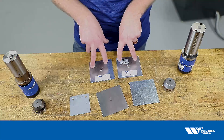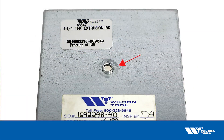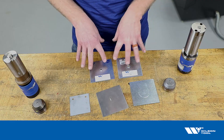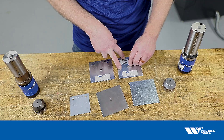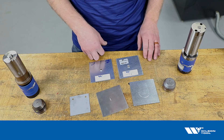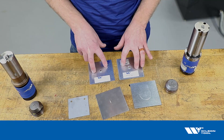Here we have an extrusion tool that has been run. This one shows a quite pronounced witness mark, and this one shows no witness mark at all. We would say that you always want to see with a forming tool somewhat of a witness mark. This one is a little on the heavy side, but I can't feel it with my fingernail — it's not a depression in the material — it just shows the idea well.